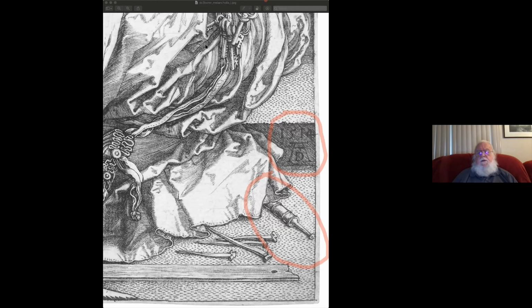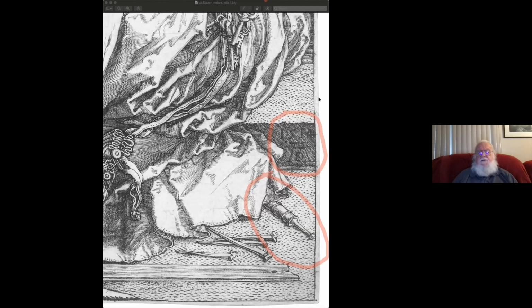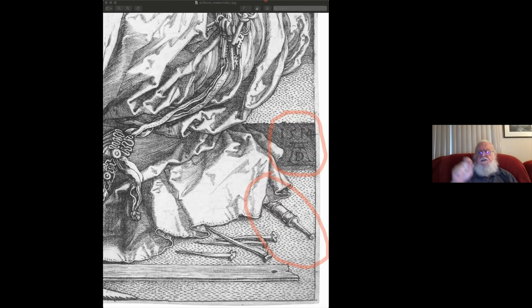Those nails have been pulled. You can see the bends and the twists in the nails. And that's why I thought of the nail puller, because that is tradition. In the 1800s, in my time period, they're not using the claw of a hammer unless you're up on a ladder or something like that. But if you're in a shop, you use nail pullers because a cut nail could be extracted almost intact and reused somewhere else. Even these nails could be straightened out on an anvil or a flat iron and just reused.